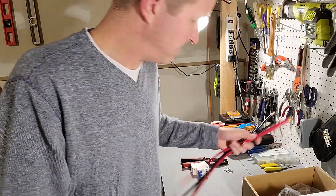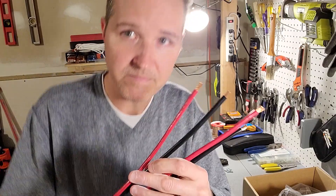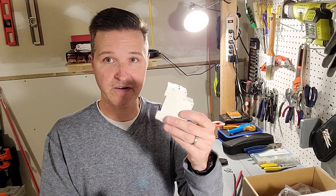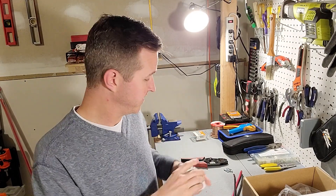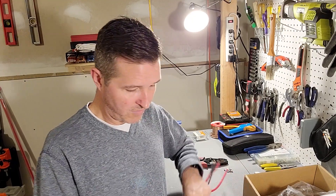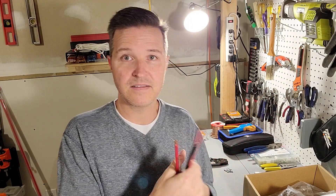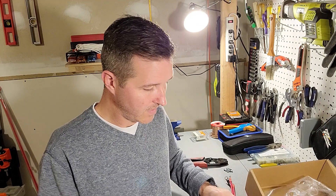I have some seven gauge cable and a 32 amp circuit breaker to protect my system from anything that happens if this thing short circuits — that circuit breaker should catch that. I'll also be connecting it directly to my other inverter, which is in line with a 150 amp fuse. So there's another line of protection between this little $90 cheap Chinese inverter and my big battery bank.